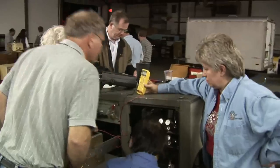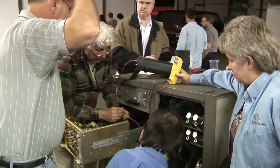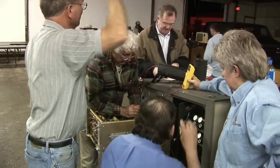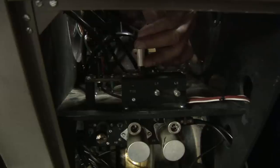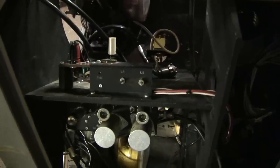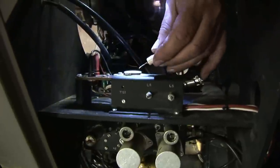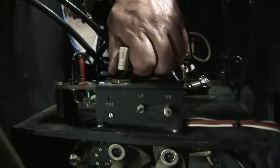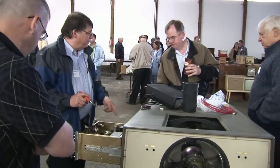I understand, but why would green come there — where does F go to? F goes to C. Now we know that C is the right one for the blue yoke. This has got to have the blue going down there somewhere. Check red — it's going up there. Green is easier — it's up there. One tenth of an ohm. D goes to C on my side. Which is A, B — C is this one. Zero ohms? No continuity there. So I guess when I disconnected it, I pulled it out and it tugged the wire right out of it.